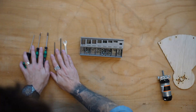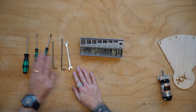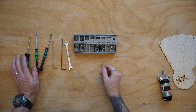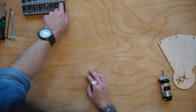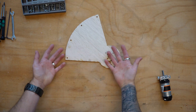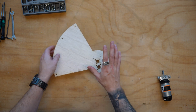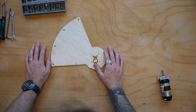The first thing is I like to start with a nice clean workbench. You're going to need a couple of tools: three millimeter and two-and-a-half millimeter Allen keys or wrench forms. I use a little drop tray to help sort screws. You'll also need some lock nuts. For the parts, you can use a laser cutter, plasma cutter, or even 3D print some of them. I have this printed in three millimeter plywood today, which is good enough for our purposes. For a more robust build, you might want to consider six millimeter plywood.